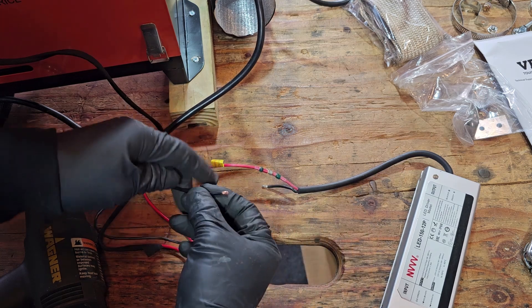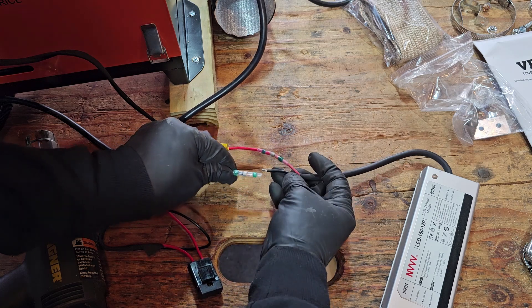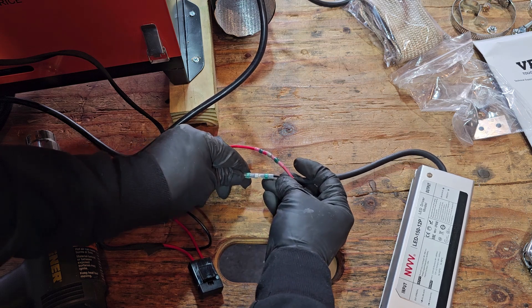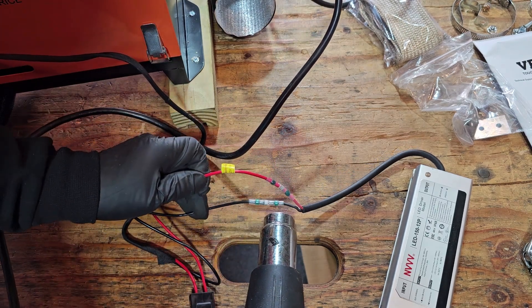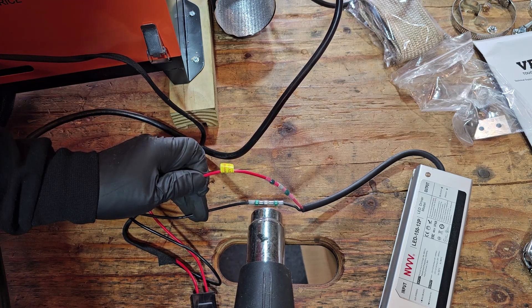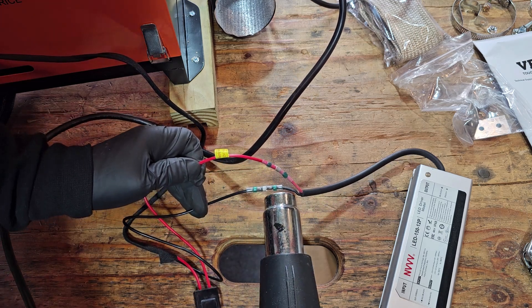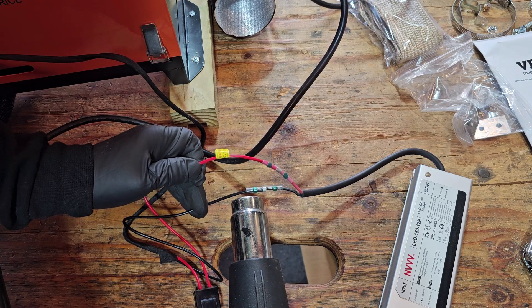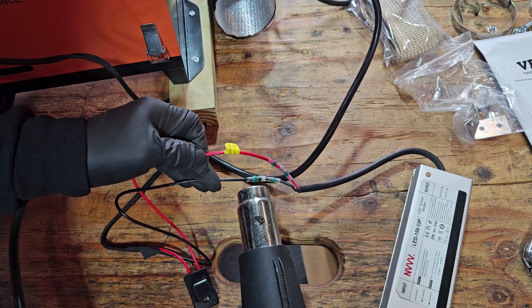It's going to be warm and a little on the loose side, so just keep that in mind until it's completely done. In the meantime, get the other connection together — make sure both connections fit and the coppers are touching. Then melt this one down the same way, hitting it from the other side and holding it a little over the copper section where the solder is, to get a nice tight fit.